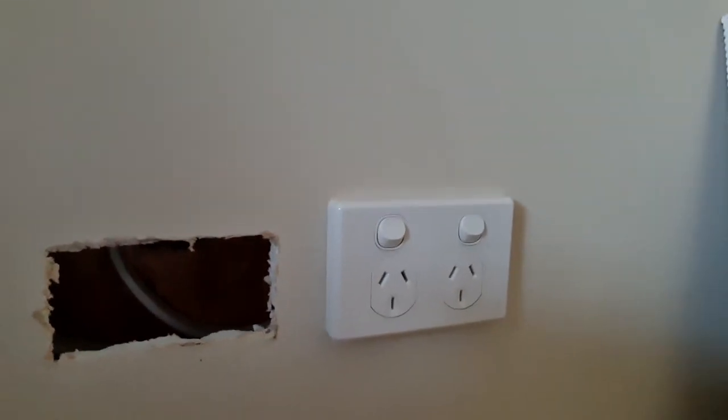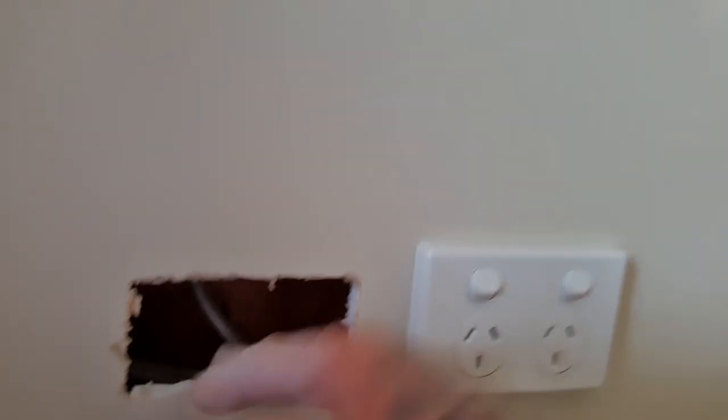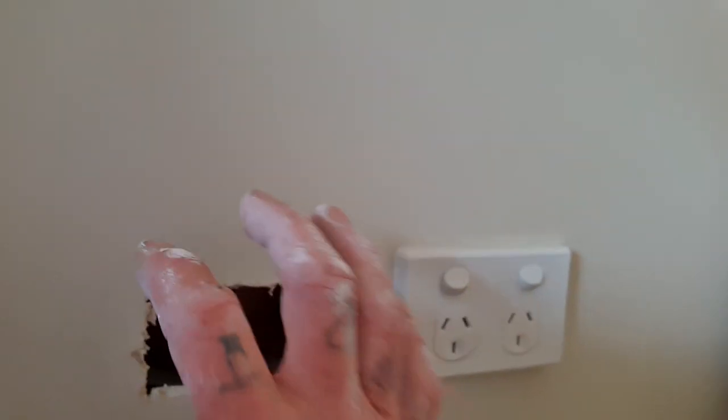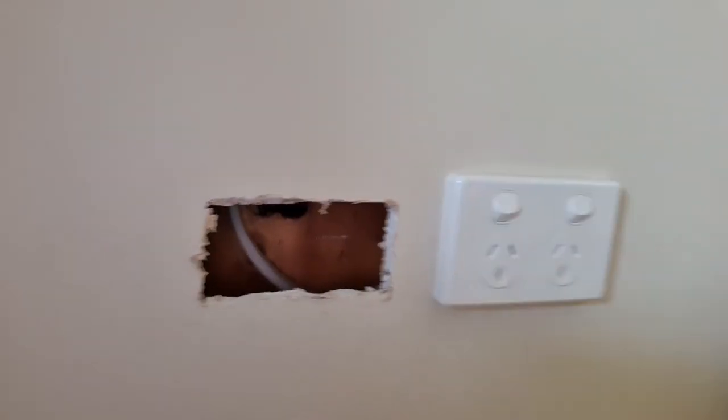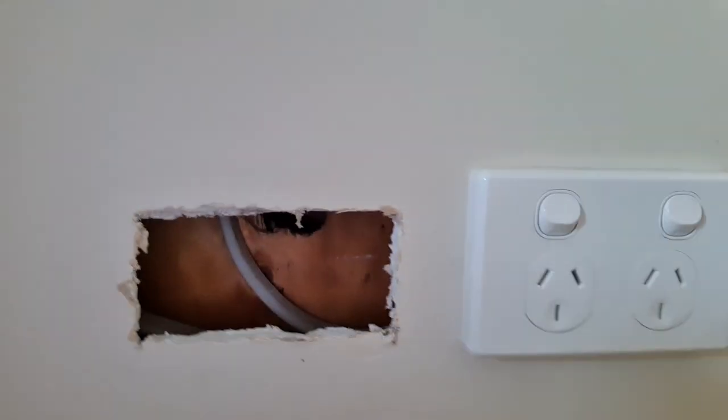Really, if I wanted to I could just cut this out, put it in, mix up the base plaster, and that would be fine. After you give it a sand — if you just overfill it a little bit — all you'll need is one base coat. But we always sand it again, give it a quick skim coat, and that's the end result. So one base coat, one skim coat — that's really all you need.